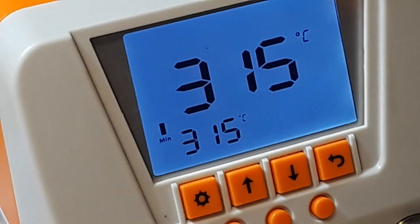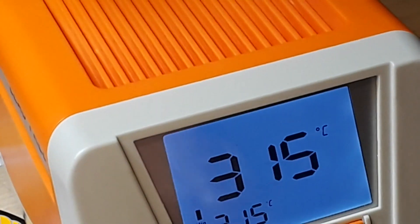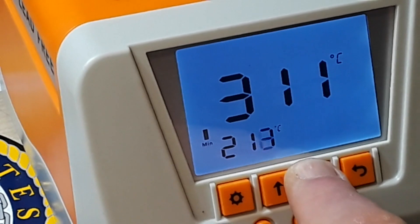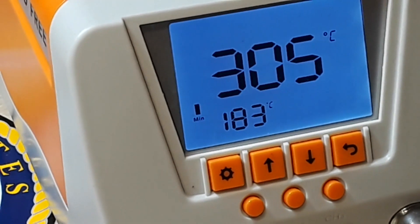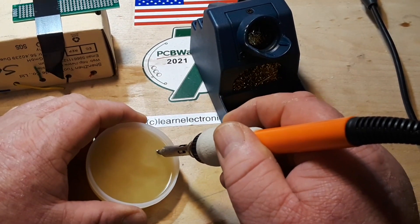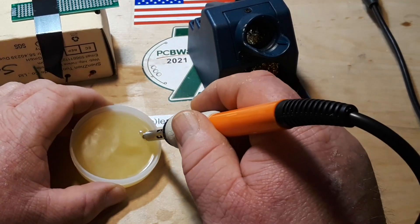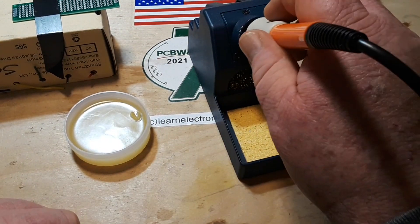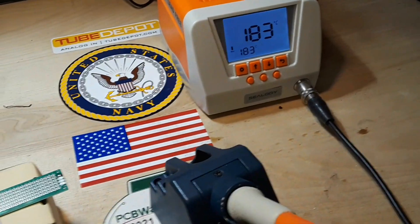As you can see, we are currently heading down to 183°C — why is that at 315? That's supposed to be at 183. Well, we'll just do it like this — down to 183. I want to make sure that I clean all that residual solder off. I'm going to do this a couple times — flux and then scrape. Now we have a nice clean tip; this should not be at all contaminated. Our soldering station is now down to temperature.